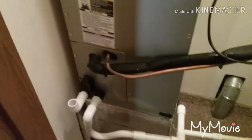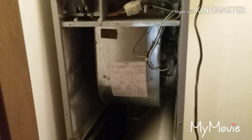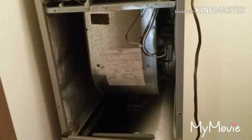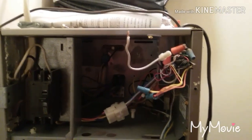With the power off, most likely it's a bad module - that's 90% the case with these ECM motors. I'm going to take a look down here at the return area. It's dry right now, so I have a shop vac handy just in case we start getting a lot of water down into that base. I'm going to put this in heat mode and try to thaw this coil out, and I'm going to disable the electric heat.